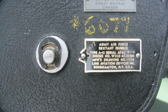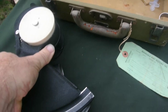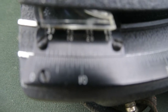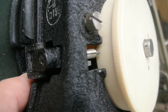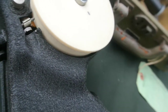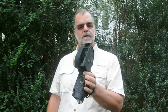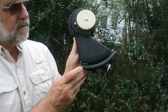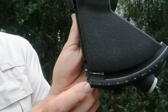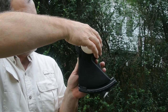There's also a patent number plate for the U.S., Great Britain, and Canada. Here is the arc, and this is a shot of the index arm with the vernier measurement. Here is the trigger mechanism — you push the trigger and it makes a mark on the drum with that lead. What you do is twist the drum to get the angle correct, get the star or sun or whatever in the bubble, then pull that trigger to make the mark, and note the time the measurement was made. Here's the index arm and vernier scale — as I rotate the drum, you can see the index arm is moving.